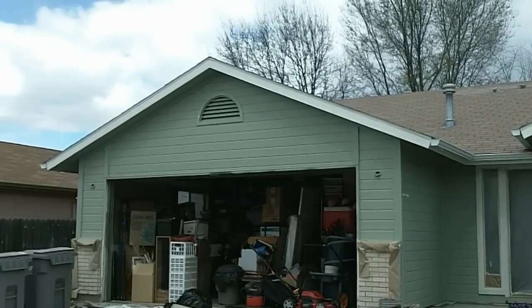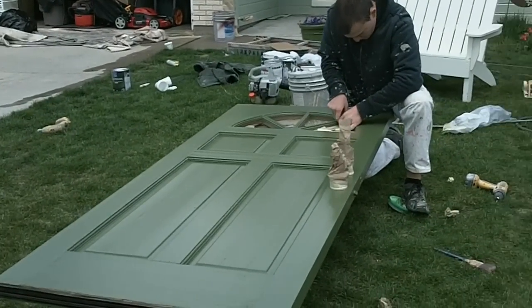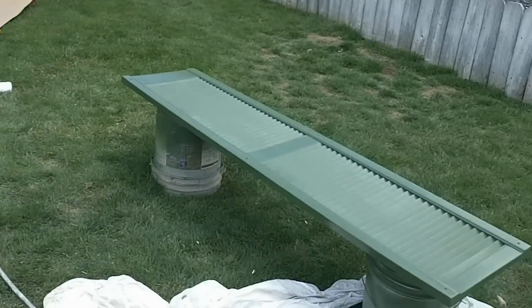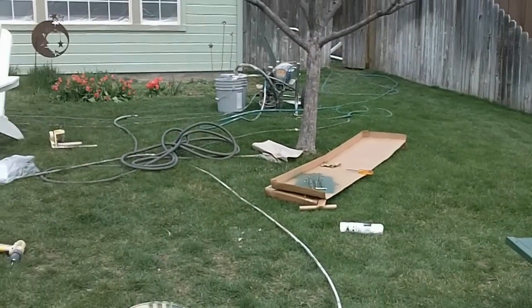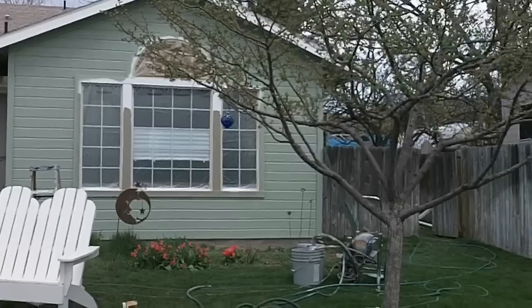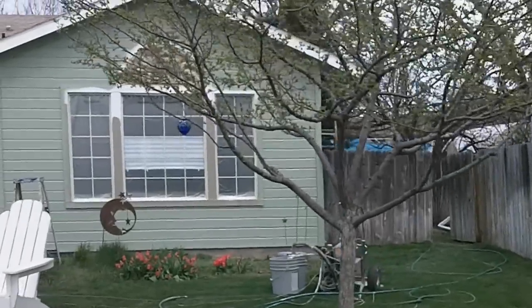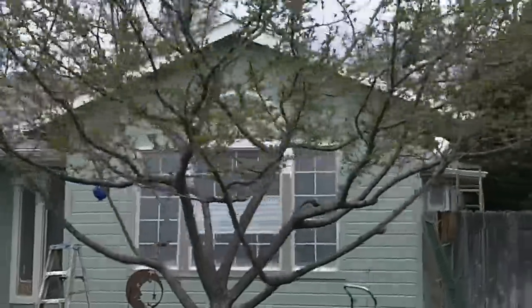Now finished spraying the front, two sides. We've got one guy working on fascia. We're getting ready to mask and spray the door. We've already started spraying the shutters, and these were brand new shutters, so we had to drill holes to install the shutters with shutter buttons. And we're working our way around doing the fascia and trim. Fascia's being done